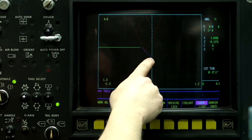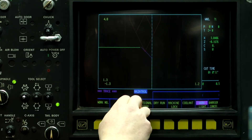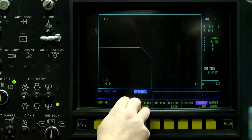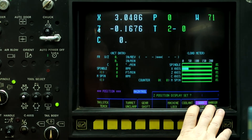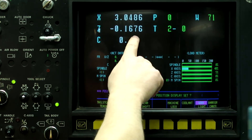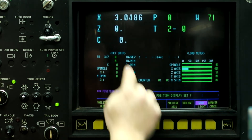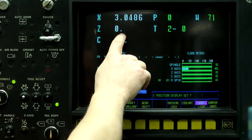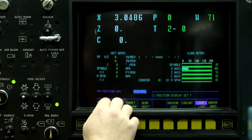So this is where the machine thinks the tool is at, but in reality it's about a quarter inch away. So go into manual, push zero, input, and now that cleared out the Z position so we can get a relative measurement.